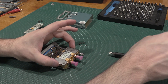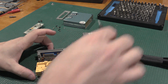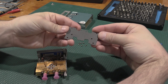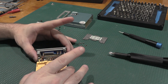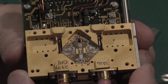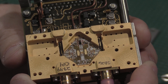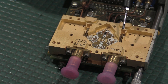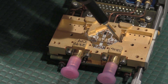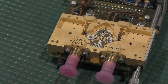That whole bottom side is RF absorber—everything under there. Look at that. The inputs are here—I am nowhere near touching the board. So that's the termination resistor, and these are the inputs to the channels over here. They branch off from there and come across. Take a look at those input resistors, because those terminators are usually what blows up when these get overloaded.